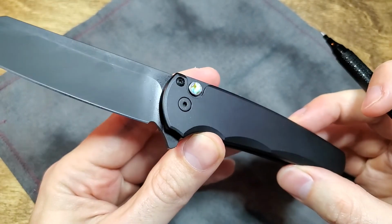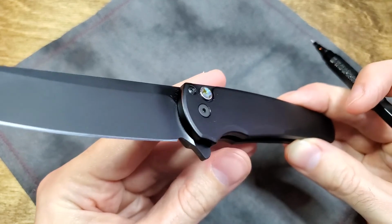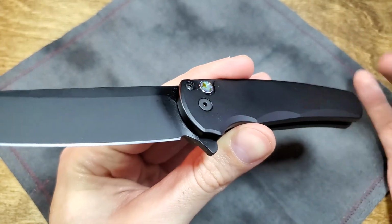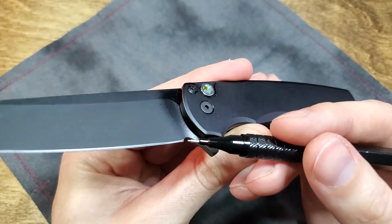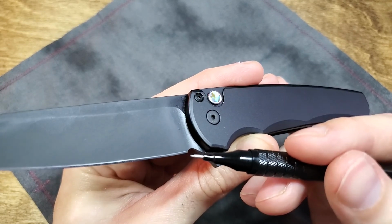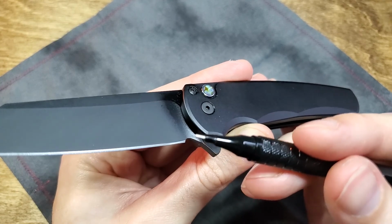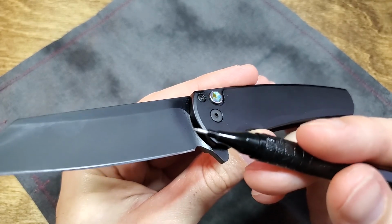After that, let's start talking about design. I also try to assess the knives from a design standpoint. And again, the ProTech is actually a pretty good example for what I want to show next. Let's talk about sharpening choils and finger choils, but specifically sharpening choils. If you're going to put a sharpening choil in your knife, you need to put it in a place where it has passed the point where the knife is reducing itself in thickness, past the point of the plunge grind.